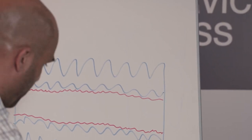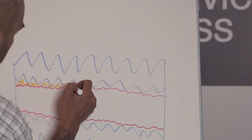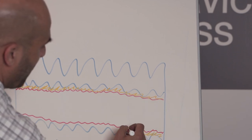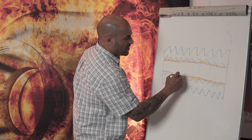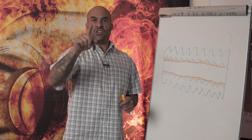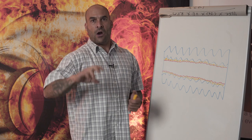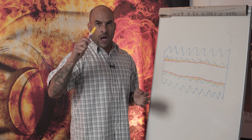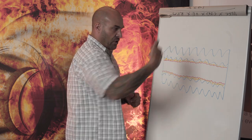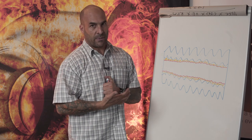And then you'll have, I'm going to use yellow, lubrication between these two surfaces. That's what prevents these two materials from actually making contact with one another. Remove that lubrication and you will find that you've got a soft material, brass or bronze type bearing, running against a hardened steel shaft. Now, one of the two materials has got a thread cut onto its surface. As that rotates at, in this specific case, 120,000 RPM, what do you think actually happens?